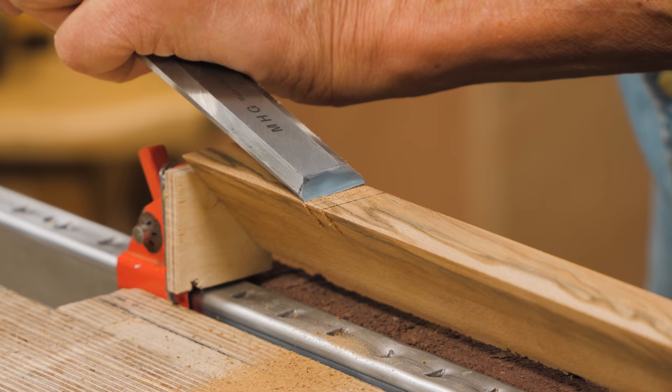Then a narrow chisel — will a 10 mil fit? It does just about, but I'm going to go with a narrower one — quarter inch. Take the ridge off and go up away from you. I'm going down. I'm about a sixteenth off my line. Now I'm going directly into my gauge line. I think I'm in my gauge line. Now I'm going to offer the steel into there, and that will help us evaluate how deep we've gone.